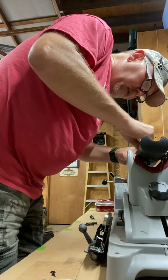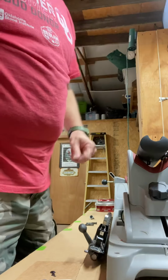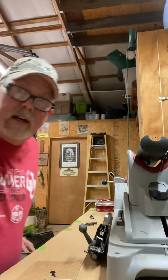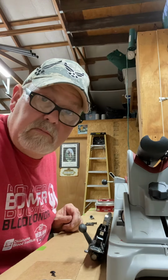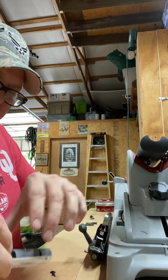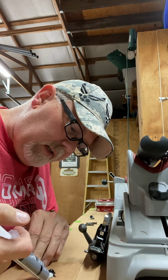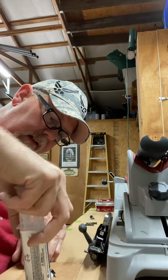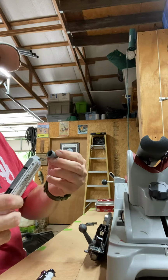Now, some of these come with an oversized lug area, expecting that you're going to epoxy bed. So, you know, there's a lot of guns out there. I did one the other day, and it had a Bell & Carlson stock on it. Guy brought it to me, and he's like, hey, can you epoxy bed this for me, you know? Well, I thought, sure, no problem. I don't know what could be too wrong with a Bell & Carlson stock, but let's take a look at it. As I went through the process of taking it apart, I realized the lug valley was so oversized, and they probably did that on purpose, just because they wanted to give you enough room to get epoxy in there and do everything you should do to do that correctly.